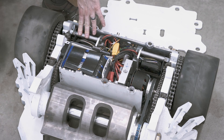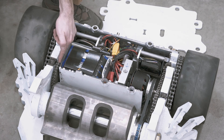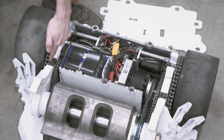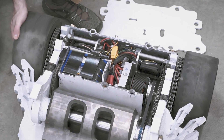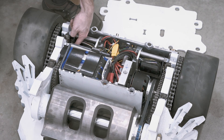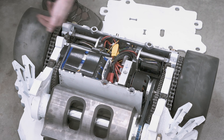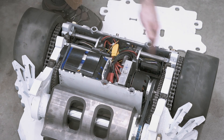The drive runs into a chain — it's a two-stage chain reduction. We have a small sprocket into a big sprocket, which goes through the frame via a bearing block, then into a small sprocket and into a big sprocket attached to the wheels. It is a relatively simple drive system — no gearbox per se. There's also a UHMW tab for tensioning adjustment on the belt — you just turn a screw and it presses down to tension the belt. The chains up front were pre-tensioned when we welded in the shafts, so there are no external tensioning mechanisms.